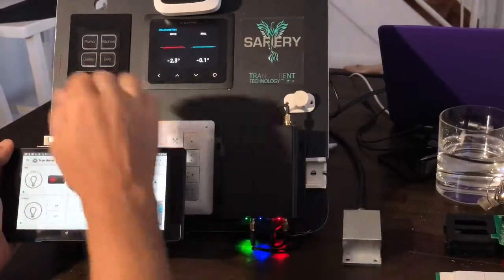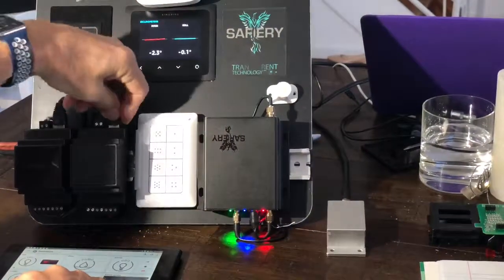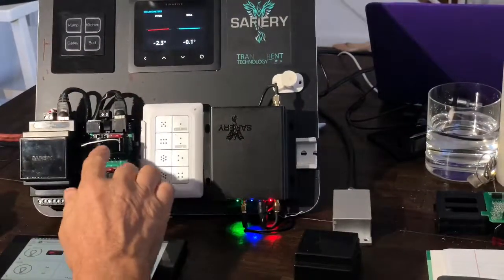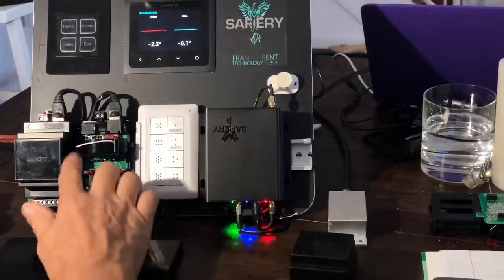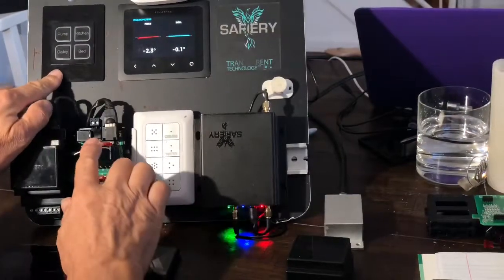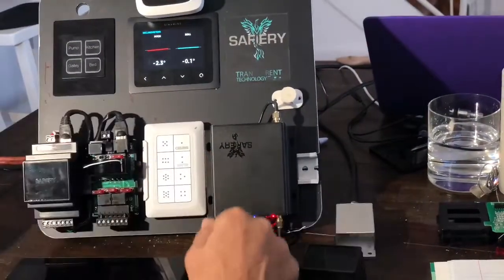So that's the display button there. These buttons can be anything at all. This is the actual smart IO. This is the RJ45 and power, and this is coming out to the lights. If I just take this off for a minute, you can see that I've got on here relays, fuses, and this is the wireless controller — that plugs onto the pins here and you tighten it up. And they're all fused outputs. So it's pretty simple. You have this connected with the RJ connector, and this has got 12 volt power connected between the two of them. And away we go.